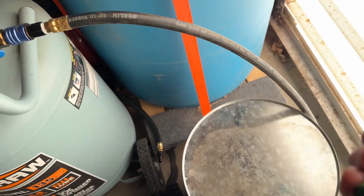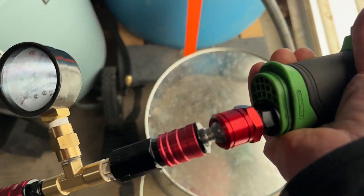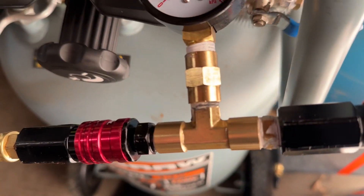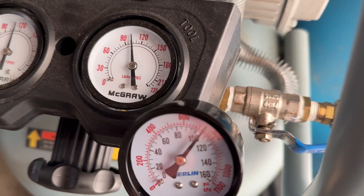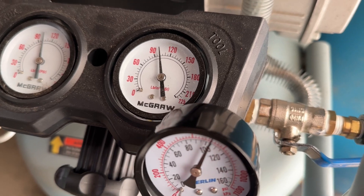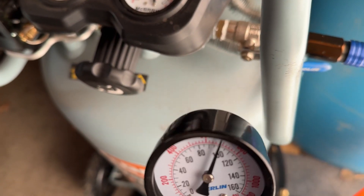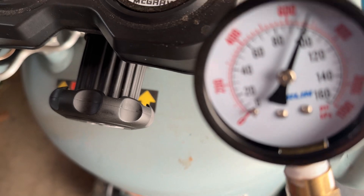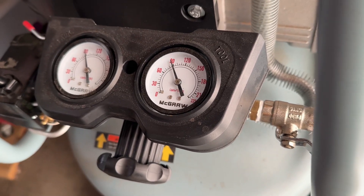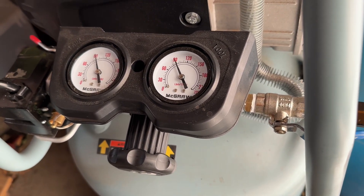So I just have a short, like eight foot hose. I put that meter back on here, showing the 100, and I have my air impact wrench. I'm going to put this close to it so that the two gauges are close. When I pull the trigger, you're going to see the major drop. And you're going to see that this one showed about 60 PSI, and this one showed a little bit more — about 70 to 80. I'm going to have to let the compressor fill up again and then I'll explain exactly what was going on here.